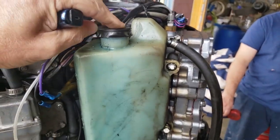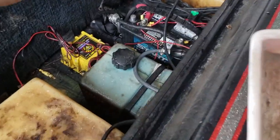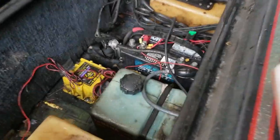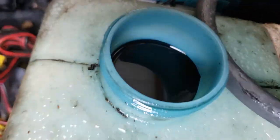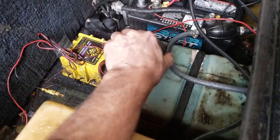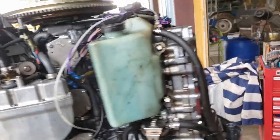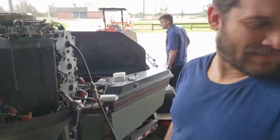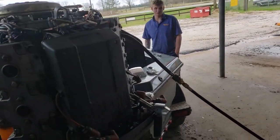The customer stated the oil tank on the engine was empty when he checked it. When we received the boat, maybe he filled it back up — I talked to him on the phone and asked if he had checked that tank, and he said he did not check it. But this tank, as we received the boat this morning, happens to be full to the very top. Either he just filled it up or I just don't know. The number two piston is burned pretty badly and it's definitely going to require that cylinder be worked on.